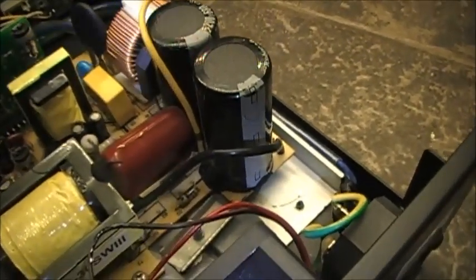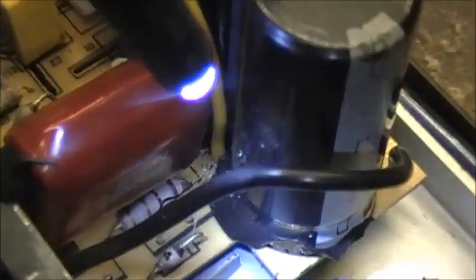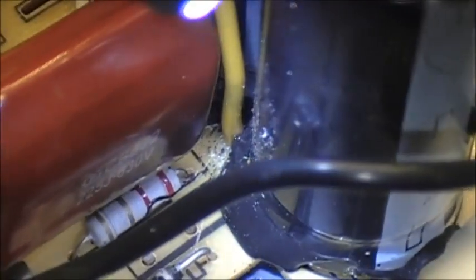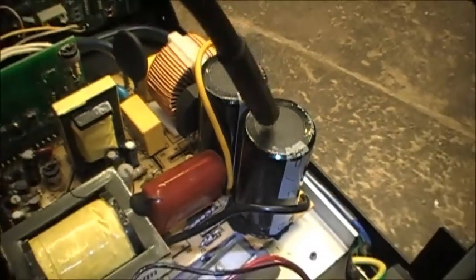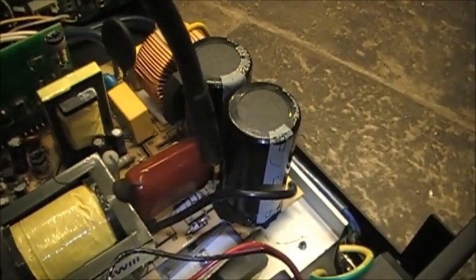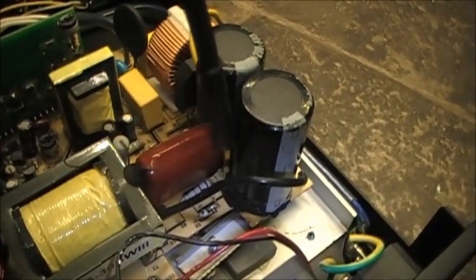Let's see if I can give you a bit more light. So yeah, just to the right of that resistor, and between those two capacitors straight down, you solder this yellow wire — white, blue, whatever color you want to use — between here and down there, and that's it.